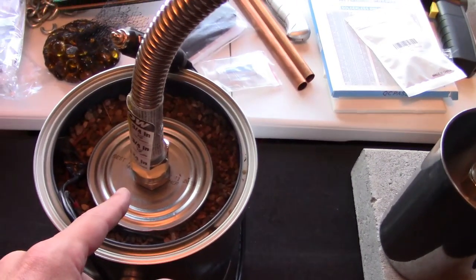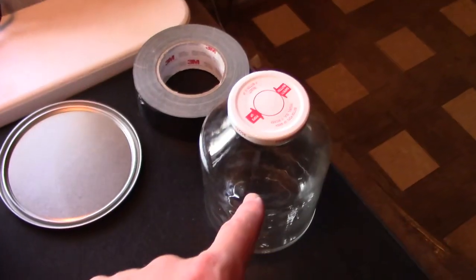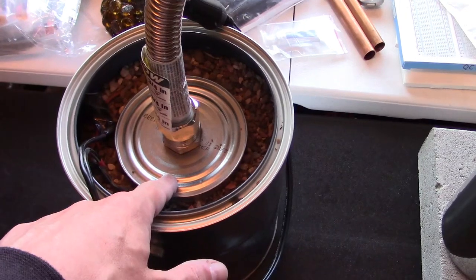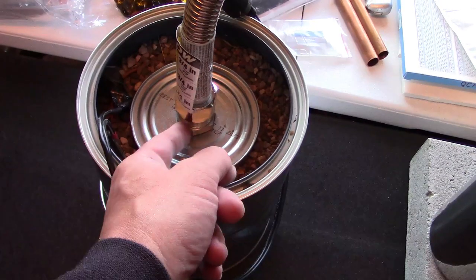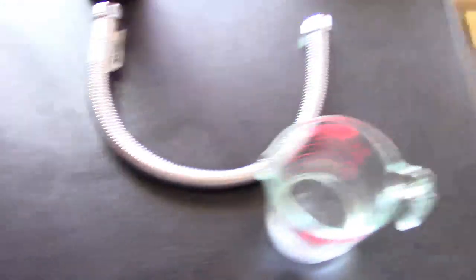We got the stainless steel connector adapter, the stainless steel two-foot tube, and the stainless steel collection vessel. I'm also using glass as an option. The only thing that's just steel and not stainless steel is the can that holds the dirty or salt water — but that doesn't matter because we're not collecting the actual water, just the steam. When it becomes steam it only touches the stainless steel components and the glass collection vessel. The table is perfectly fine; it doesn't get warm enough on the bottom since the inner can sits about an inch and a half inside the outer can.